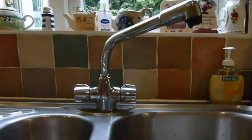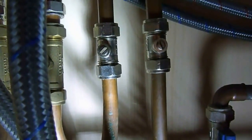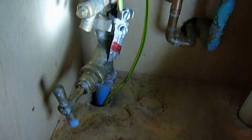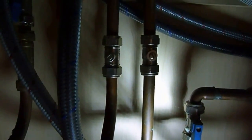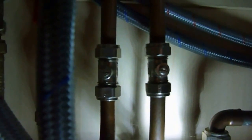If you look under the sink, in this particular instance you'll see we've got a couple of valves. I'll put the torch here so we're alright. We're going to turn these two valves off to isolate the taps. If you haven't got any valves under there, just shut your main water off - in this instance we do have a main stopcock. So we'll get those shut off first. There we are - our two valves are shut across ways.